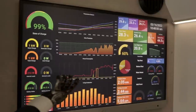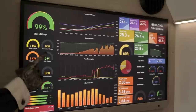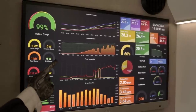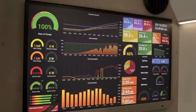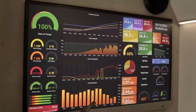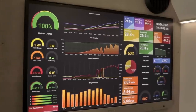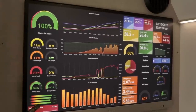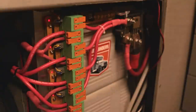As you can see on our Grafana display — video on that coming up soon — we're at 99% state of charge, pulling in about 1000 watts, although it is a sun-and-cloud sort of day, so we're fluctuating between 600 and 1000 watts. It's been a little rainy lately as you can see in this 14-day historical graph. Our solar production daily has been going down a little bit. We just tripped 100%, so if we pan down to our DSSR-20s, they should all be tripped over to a green LED and we should be making heat.